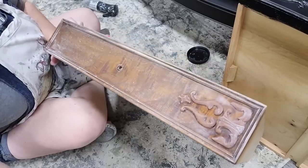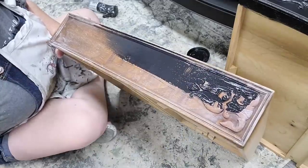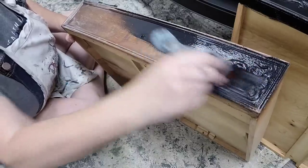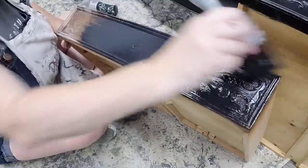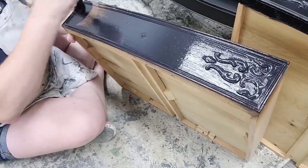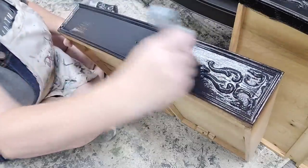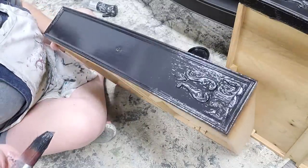For the second drawer, I fill my brush a little heavy on paint. Since I can't use water to reactivate this paint, I use the moisture from the paint itself to elongate it — keep it nice and wet. Once an area is clean, I try not to go back and touch it. Long even brush strokes, working in small areas. Silk also sprays really well and can be applied with a roller, which helps on large open spaces like a dresser top.